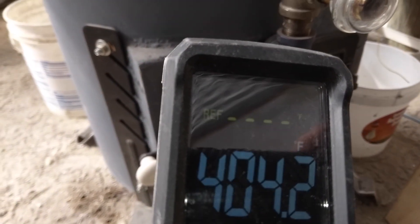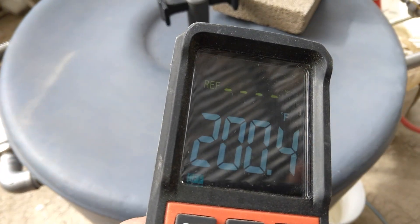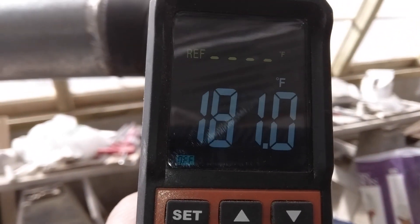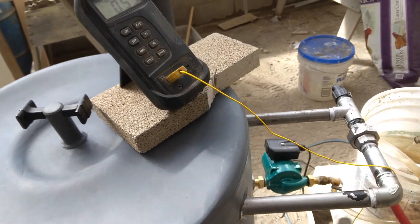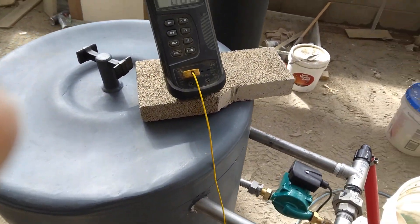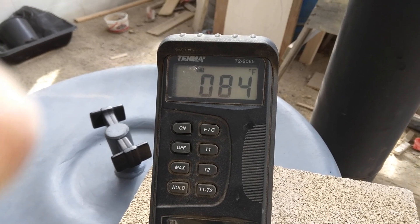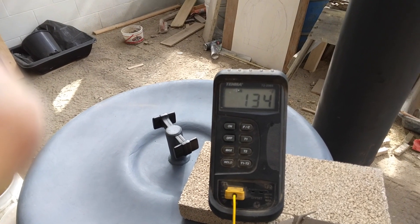The face of the door and door frame are getting up there. Top of the stove is around 200 degrees. The exhaust temp is getting close to 200 degrees, and it drops down pretty quickly — so we're extracting almost all the heat we can out of that fire. I put a fire brick on top for the meter so it doesn't melt. The return line is about 83 degrees, and the outgoing temp is 134 degrees.